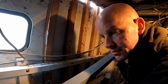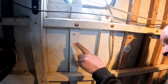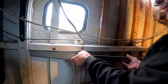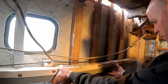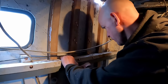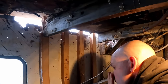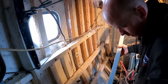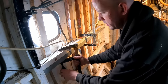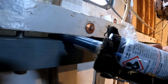So I've just made a sister, so to reveal it. Reveal it, is that what it's called? It's revealed itself because of these nails here. Now, we'll get some bolts out, get some glue out, and then we'll have to force it in a little bit because of the hull curves. Okay, while you're doing that, I'll make the packer. Right, let's get this fit. So we'll clamp it up, drill it, then move it back and put the bolts in, and then we'll put the glue in.